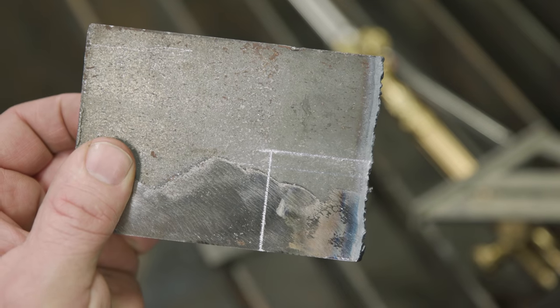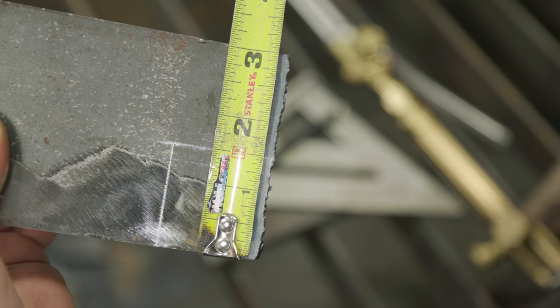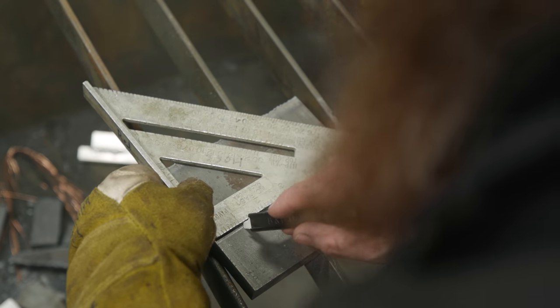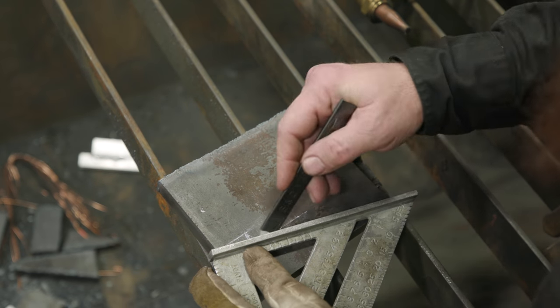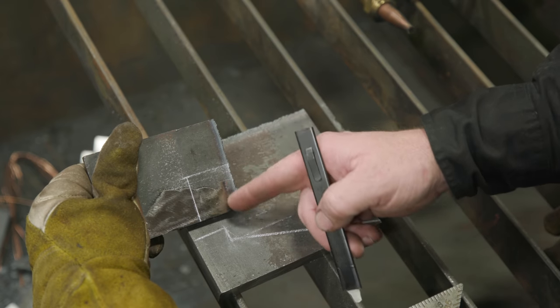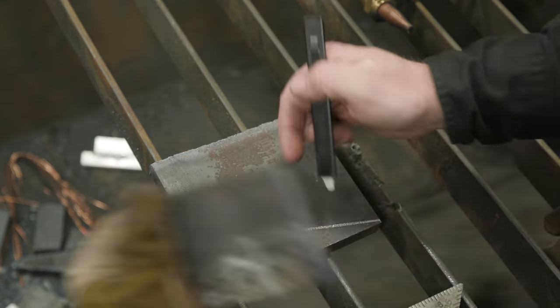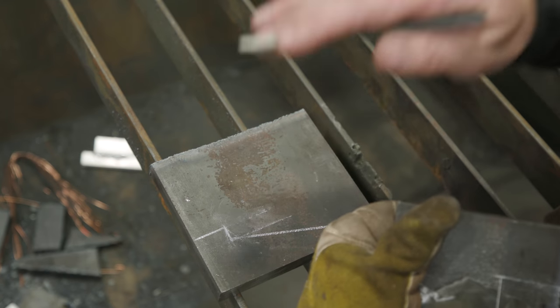That's it for the dog — that's the plate dog right there, only inch and a half up. I did that because I'm only going to make the height of my wedge an inch and a half too. If you're going to make a two-inch wedge, cut a two-inch slot. Here's the outline of the wedge I'm going to cut out — I went up two inches, came over an inch and an eighth, down a half inch, then from that point down to zero. So from the bottom to here I have an inch and a half, the same as the plate dog, so I have a little stopper that'll keep that plate from going down any further. Let's go ahead and cut this out.